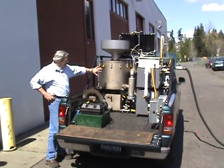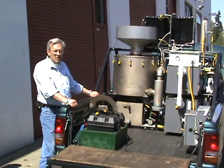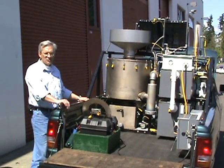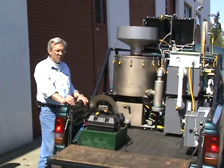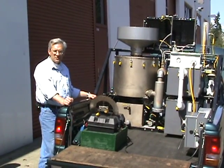Here is the core reactor of the system. The upper reactor takes basically any carbonaceous product — we're using pelletized wood products as our fuel stock to fill this hopper here. The rule of thumb on these reactors is you can get a one-ton truck to go about one mile on one pound of wood. We've got about a 40-pound hopper here, so you get about 60 to 80 miles out of this rig — though it's not a one-ton.